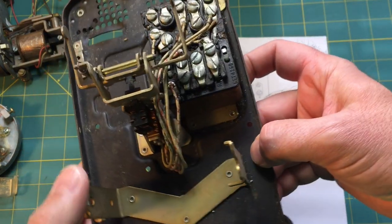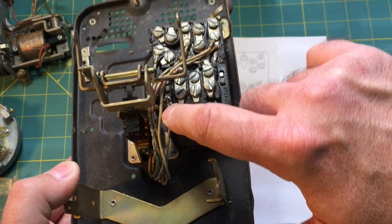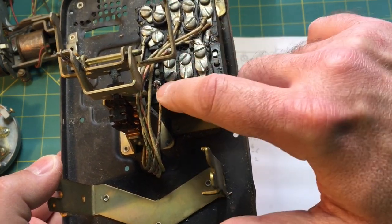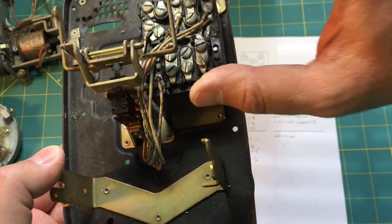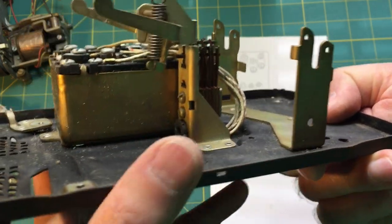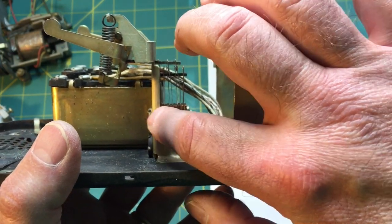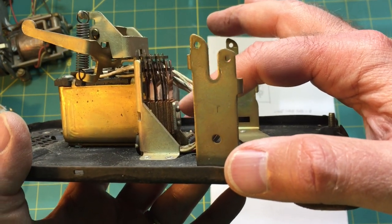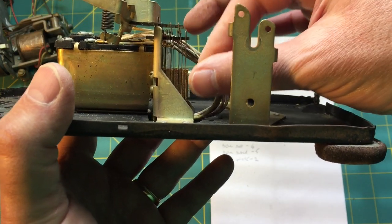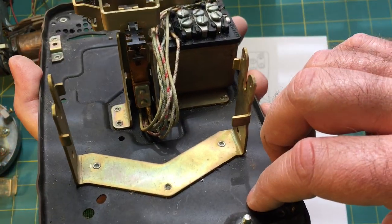There are seven wires that go up to the hybrid. I could desolder these very carefully and swing them out of the way, but I'm going to try to keep all of these connections intact as a first approach. What I'm going to do is take this mechanism apart — if I take these two screws out, they run all the way through the switch leaves and insulators back to a threaded retainer plate. If I take those two screws out and carefully disengage the different sections, I can swing them up out of the way and get in there for a proper cleaning.